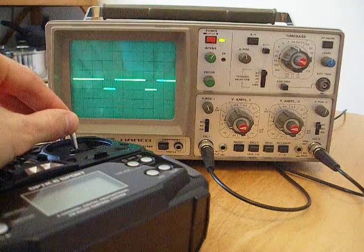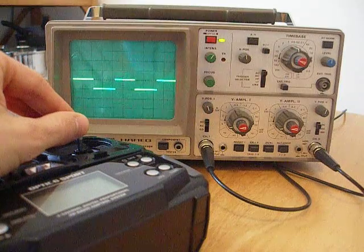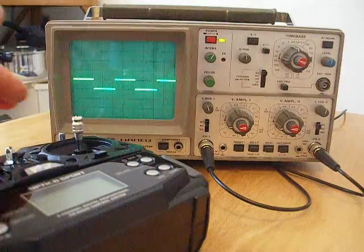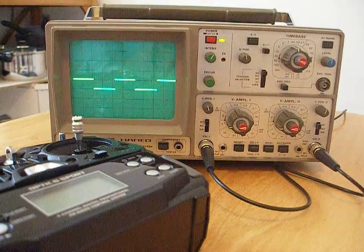This is the PWM output of the microcontroller. You see — 100%, almost 0% almost. And this is the major feature of the circuit, I would say, as the dynamics is expanded to its maximum, and full forward and full backward speeds can be achieved.